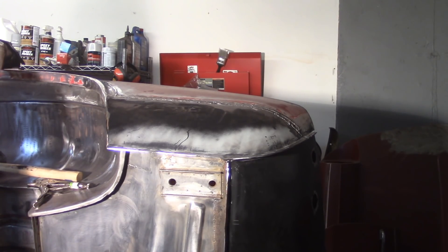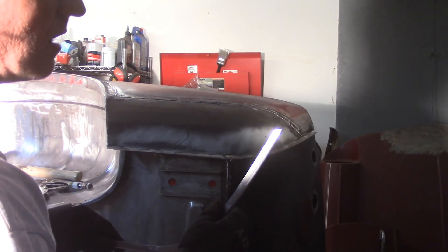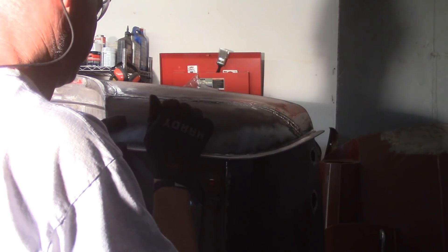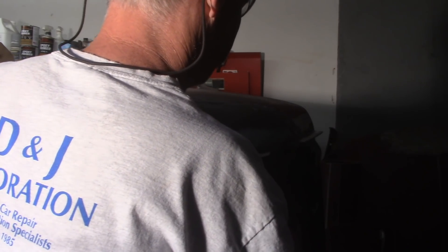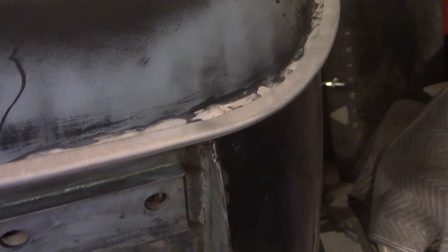Got it to about 4 tenths of an inch all the way around. The angle on the finisher should be cut differently — the forum agreed on that. Looking closer, it fits relatively flush here, but as you get into the curve it really starts to pull away and ends up way out. That angle has to be shrunk in. I'm hesitant to use a shrinker-stretcher here; I may use a clamp to try to bend it in, but last time I tried that the whole thing just moved.